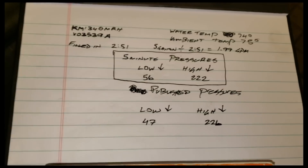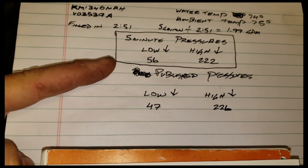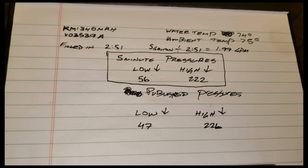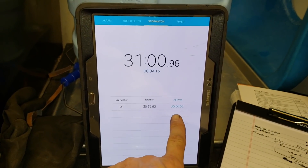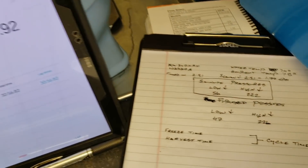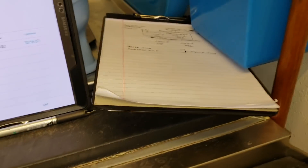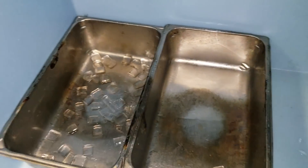We just cycled into a harvest and I pushed lap — so that's my freeze time. Now we're going to keep letting it count because we want the harvest time too, to get our total cycle time. At the same time, I'm catching all the ice cubes so I can weigh them and do a production test. The harvest time ends when the water pump turns back on.